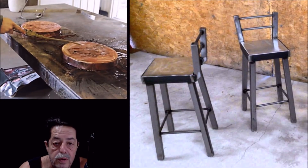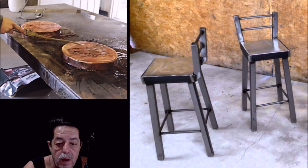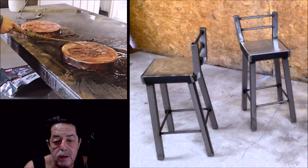Now let's look at the picture above my head where this guy has taken a log and cut slices off of it. What I do is cut logs in slices, let them sit outside to dry out really well, then sand the surface going through the grits — starting at 60 grit, then 80, 120, 150 or 180, then 220. I don't go past 220 because I'm going to put a film finish on these, and they'll turn out fine.